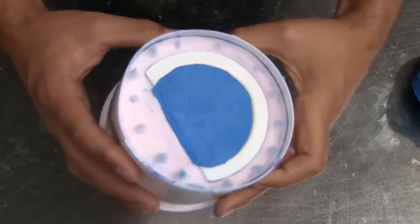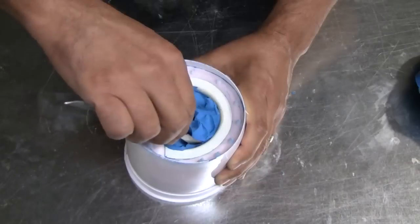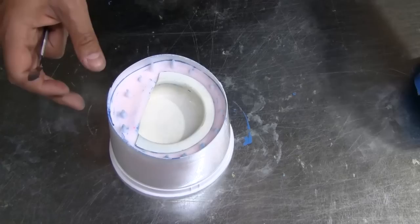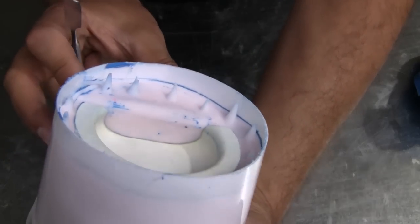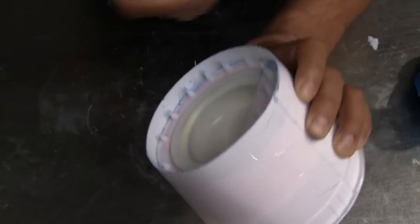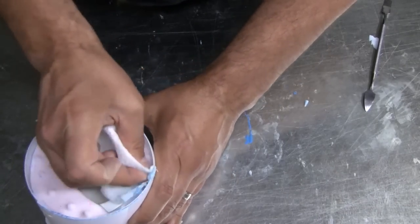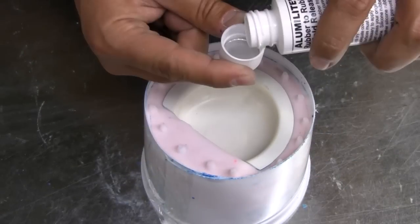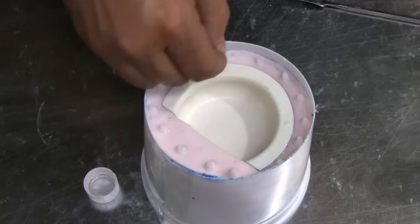Once the first half of the mold is cured, we can flip the mold box over and gently remove all the blue synthetic clay. It's important not to disturb the master, which is embedded in the first half of the silicone — you want to leave that seal intact to ensure no fresh silicone seeps in underneath your original. A little alcohol on a rag is used to clean the residue. The next and very important step is to apply mold release to the first half of cured silicone. Alumilite's rubber-to-rubber mold release was used here, applied in about three coats with five minutes of drying between coats.